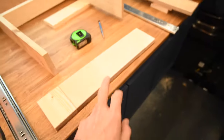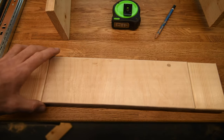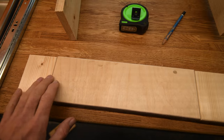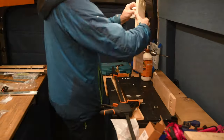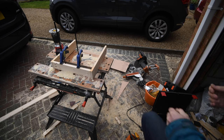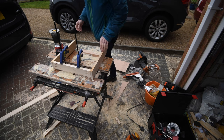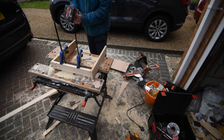Generally the door faces are going to match the style of the rest of the cupboards, and because the bit of wood I used here wasn't long enough I'll have plenty left over. Time to screw and glue this together. For the drawer bases I'm going to route a groove out — not really the best way of doing it but I haven't got the correct bits.